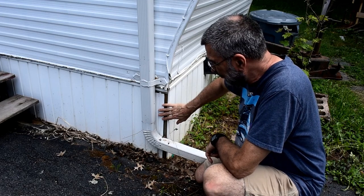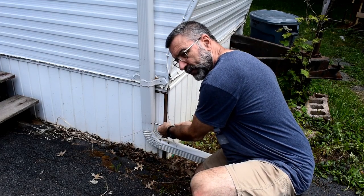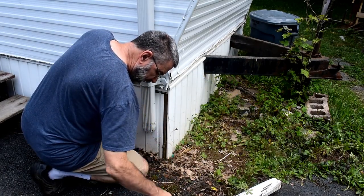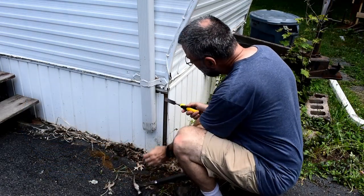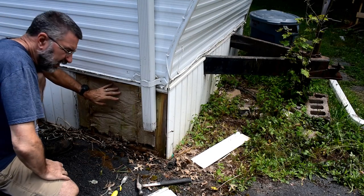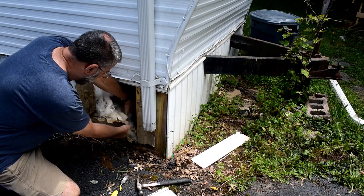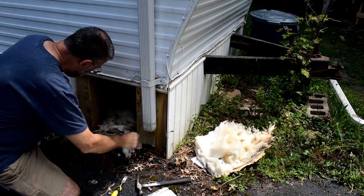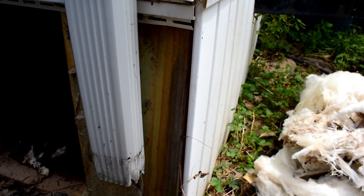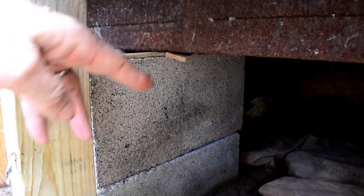It's been four years since I did this skirting and I know there's a pier under here, but I don't remember exactly where it is. The first step is to just take it apart and take a look at what I've got. You can see here what I did when I built the skirting — I just built a 2x4 wall and then stapled regular house insulation into it. Here's the cinder block pier right here — here's the corner of the trailer, you can see the cinder block, the frame sitting on it, with a couple of wood shims underneath.